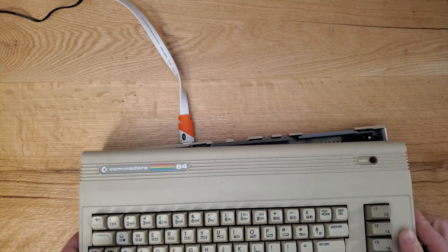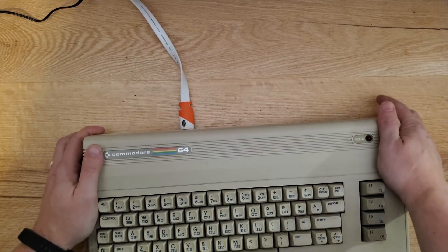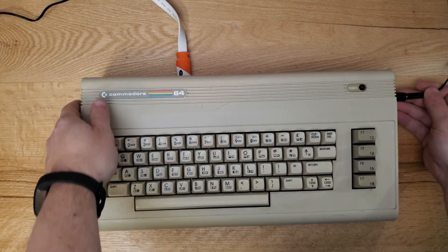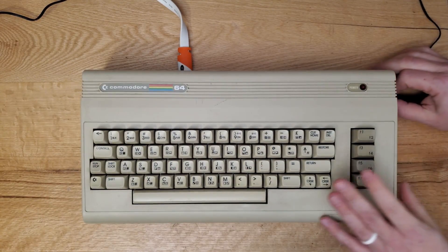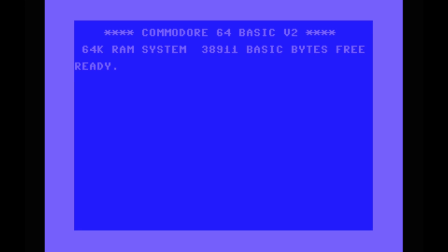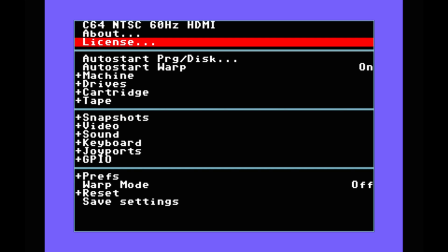Before I assembled the machine, I also went to the BMC64 project pages and went looking for the system files needed to get this working. Before you put something like this together, it's a good idea to make sure you can get it mostly working before you have to do the last configurations. For the most part, this was as simple as dragging and dropping a file directory to an SD card, and then I had to get some Commodore-specific ROMs. Pretty close to the same thing I had to do for my previous Commodore project, when I put an Elite 64 motherboard in a VIC-20 — I'll link to that in the description.